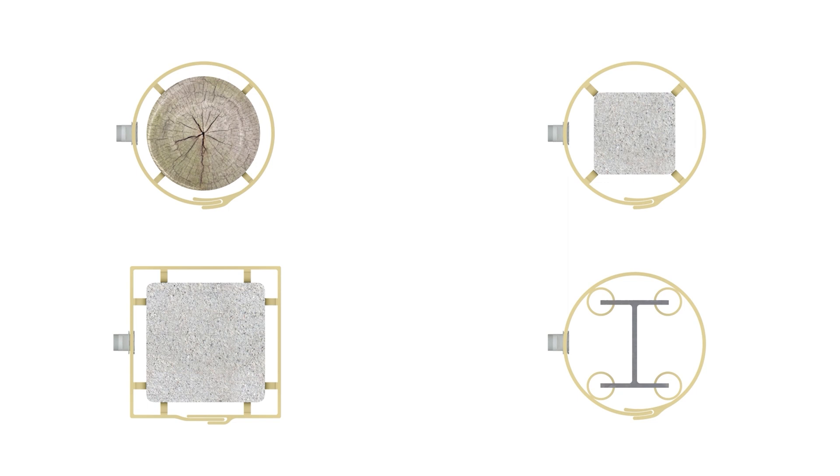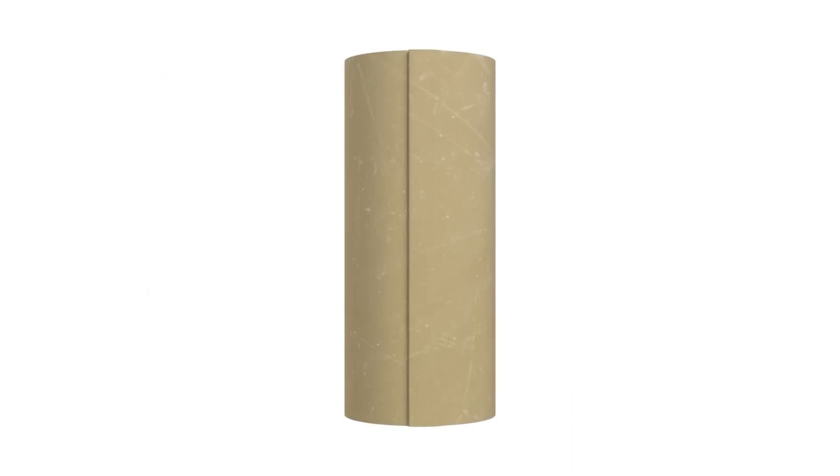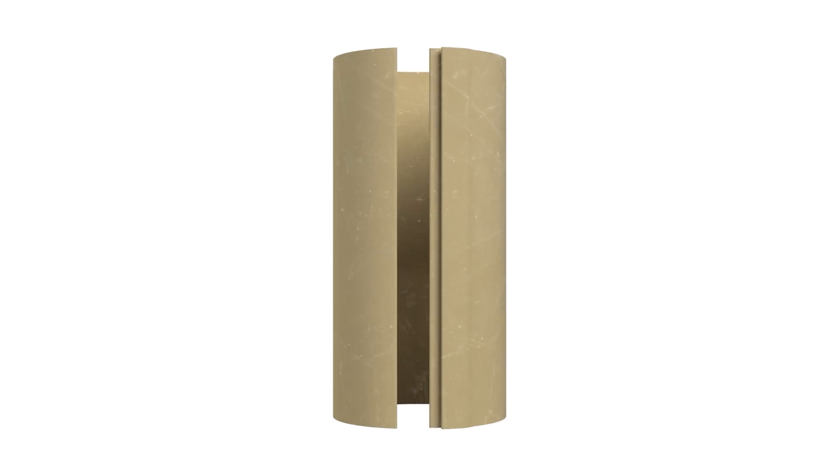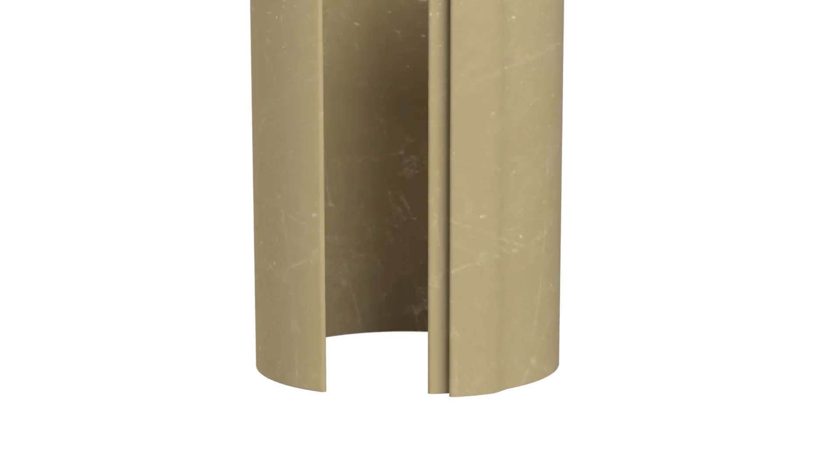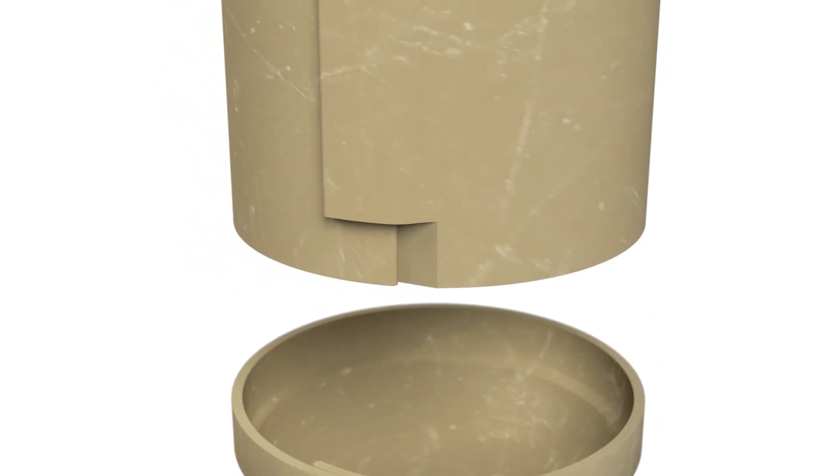Note that installation and positioning of FX Spacers and Pumping Ports are varied by application. Jacket surfaces must be undamaged, clean, and free of all contaminants. If installing multiple jackets on one pile, trim the bottom 3 inches of the tongue and groove joint of the top jacket so that it will fit into the bell of the bottom jacket.